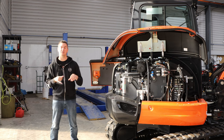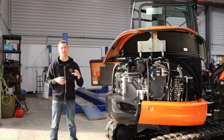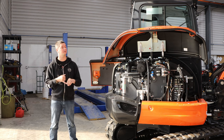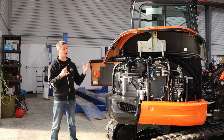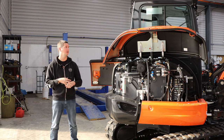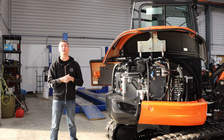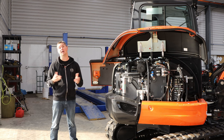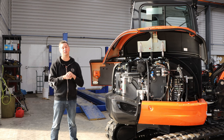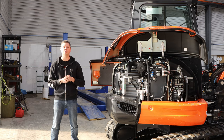Hopefully today we've been able to bring you some key facts — your digging depths, breakout forces, lift capacities, and a discussion about the cab. Even bringing it back to this day and age, at the cost of this unit, you're still dealing with halogen lights — there's a pair of work lights up front and on the boom, and those should all be LEDs. The cab itself is quite a bit smaller and comfort is brought down on that end. Hopefully when they come out with a dash-two update, they address some of those aspects. But overall, it's a bulletproof machine that's going to dig a lot of holes for you. If you enjoyed today's video, please like and subscribe, and if you have any comments, please drop them below. Thank you.